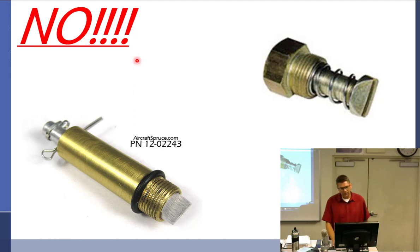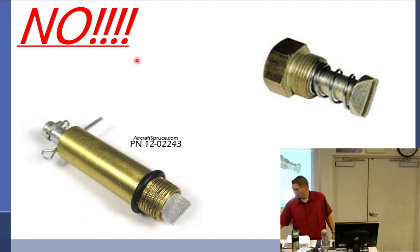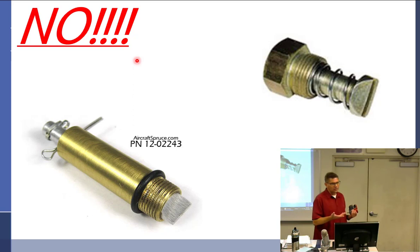I'll say this now because it's worth saying and it's a great story. You guys have now experienced what it's like to try and time this, some of you. You put it in a spot and it kind of wants to wander away, right? Now imagine you get the red tooth in the window. When you time an engine, it's three steps: put the engine where number one's supposed to fire, put this where number one is supposed to fire, and put them together. It's not hard. You put the engine where it's supposed to fire, and it stays put.